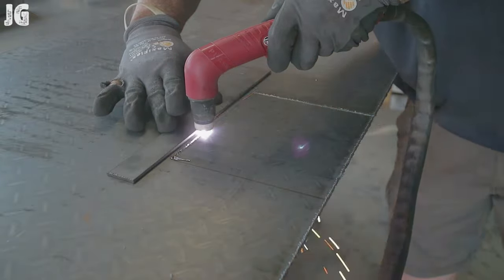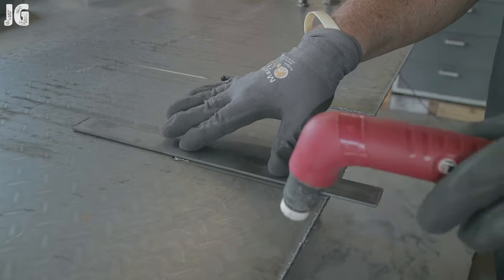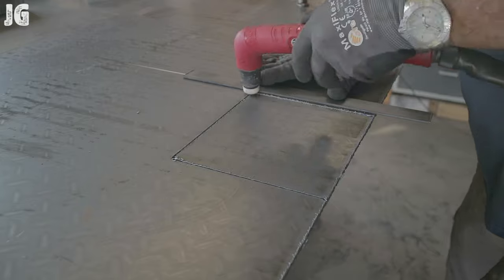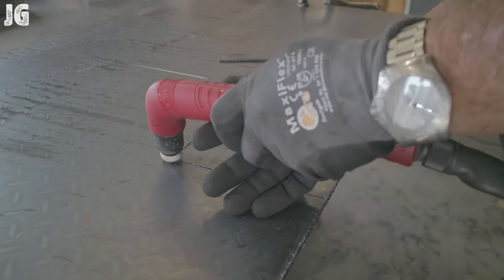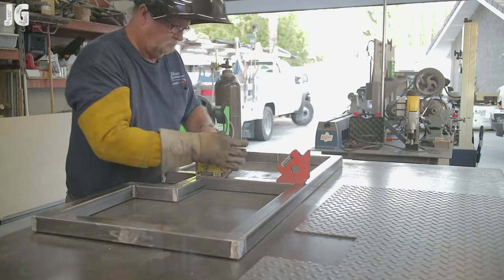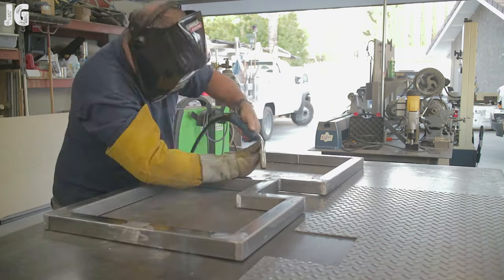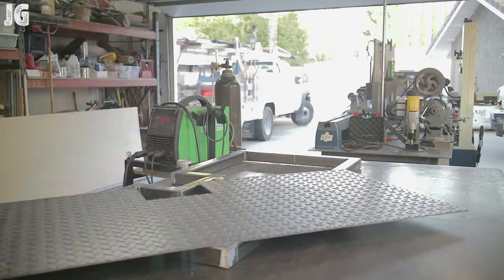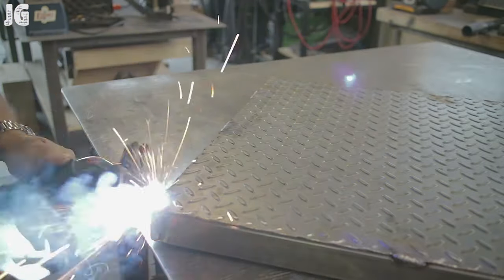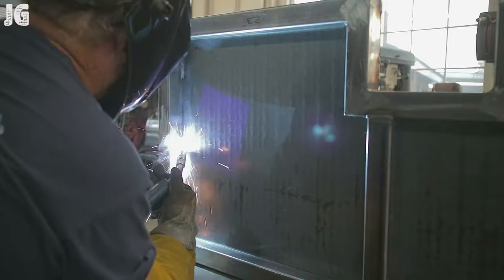I'm cutting a little niche out for the hydrant itself that comes out of the vault. You can see how this thing cuts really clean but still doesn't quite get through — I had to go back into a couple of corners and make sure I cut things all the way through before it fell out. Then finishing up the bracing: I got a brace that needed to go in the center, so we got that welded in and ground down. Then it's time to put the diamond plate on — I'm stitch welding it about every eight inches apart with about an inch-and-a-half weld, both inside and outside.